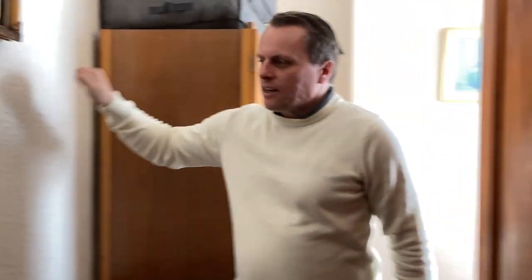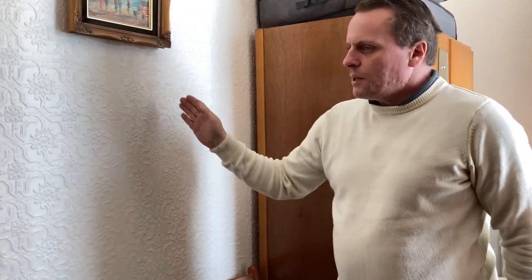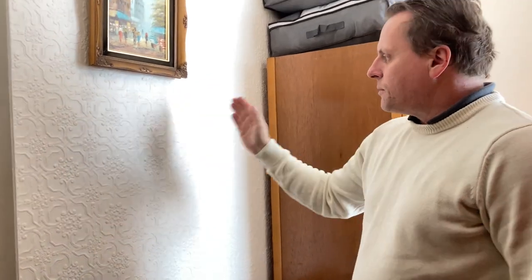One final note: this wall is actually masonry with some blown areas of plaster. Sometimes a wall will be stud work, and because it's stud work people say it's not load-bearing — but it can be stud work and load-bearing, or masonry and non-load-bearing. The only way to determine if it's load-bearing is to look at the loadings being imposed upon it and how they're distributed down through the property. If it were load-bearing stud work, there'd be big diagonal braces cut into the wall to help distribute the load.